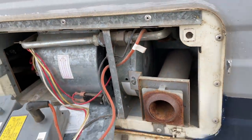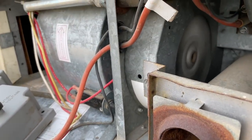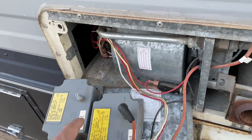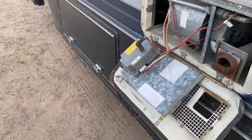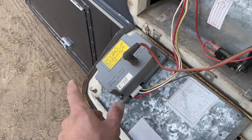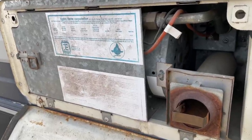No, it doesn't want to fire. Attempt number 276 — sparking but no fire. I'll turn this off and hook up the old control board so I don't have to mount this one. The answer to that was no — the igniter would not ignite at all with the other control board. So I swapped those out. I'm going to cycle it off and on again to make sure it works before I button it up. It's really annoying when you put something back together that was working and then it quits working.